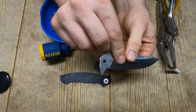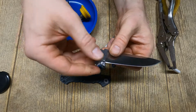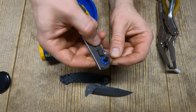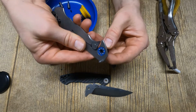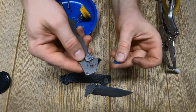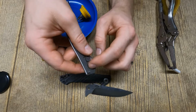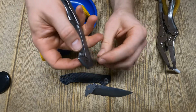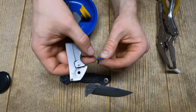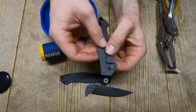So that leaves more thickness to the blade back in the knife portion. I like to see that because it means there's going to be a bit more durability there. These bearings are recessed around the pivot, not a keyed pivot. There that is. And then those bearings look like they're just riding on the titanium, which is probably fine. It might be nice to see a little bit of a steel washer there, but because they've recessed the bearing completely into the titanium on that side, there's not as much thickness here. Since it's titanium, I don't anticipate that being a problem as far as durability, but I can see why they didn't take it down enough to do a stainless steel washer in there.